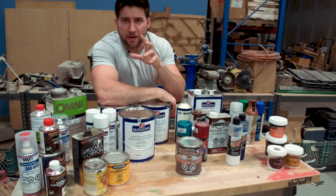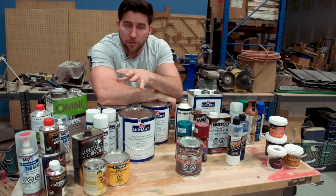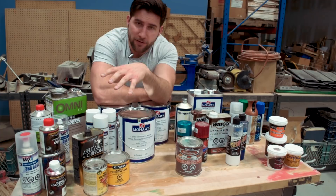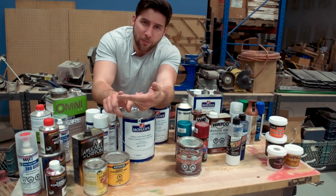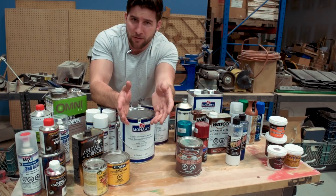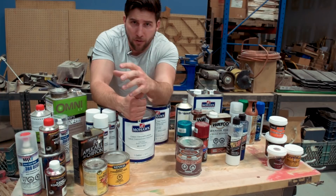Now we've moved through quite a few interesting options and we're going to get into some of the more classic stuff — things you'd expect to see on factory-finished guitars or a lot of custom shop guitars. I'm going to start by saying polyester I do not have here. Polyester is a really nice finish — a great option — but it's very difficult to use if you don't have the right equipment and expertise. A lot of Fenders, after they stopped using nitrocellulose lacquer, moved to polyester. It's harder, it's a faster operating finish, it holds color wonderfully, but you can ruin a paint gun with it quickly. If you're using polyester finishes, you're probably not coming to me for a video on what paint to use. I generally don't use it, but if I did, I'd probably pick up some Symtec Sealer.